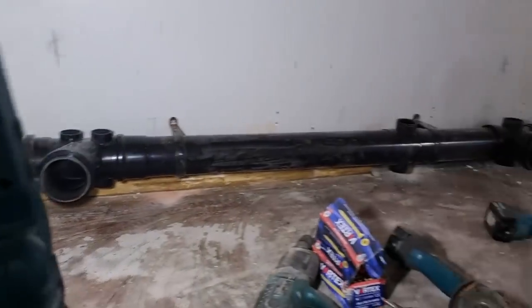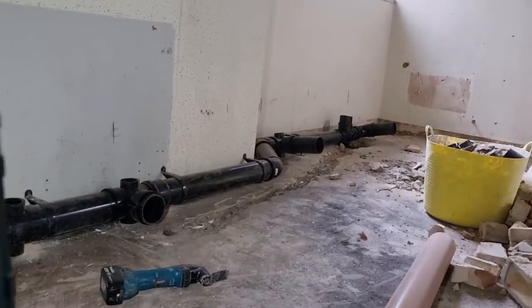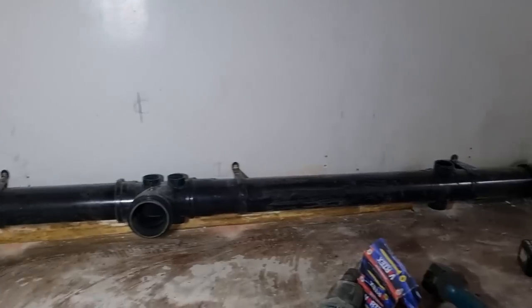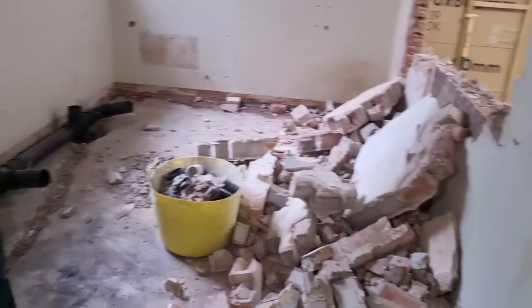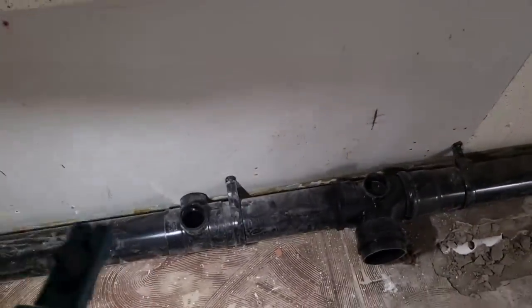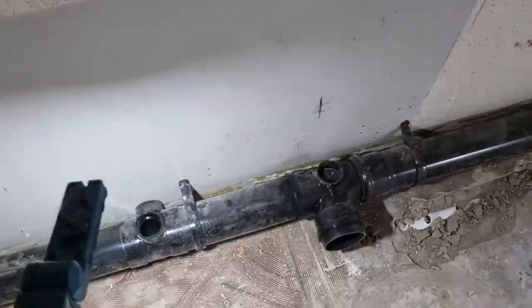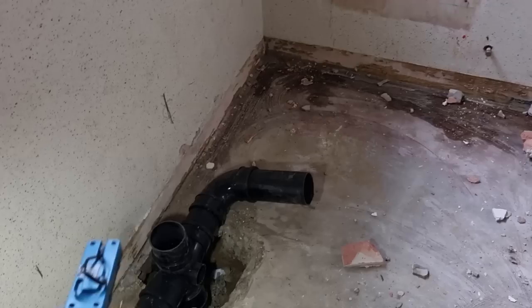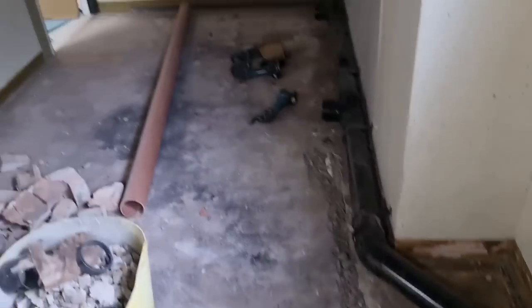Right, that's got that soil pipe all run in. You can see I've got a perfect fall across there all the way back — that'll be absolutely fine. I've done these before like that and never had an issue. It's no different to running it under the ground and teeing it in — the falls are just above ground. Just a good tidy up now. That's a really good start. It's all clipped absolutely solid — you could walk on that. Waste pipes will boss into there; I'll just put a two-inch tee and bring inch and a half into the walls. I'm missing a short boss socket for there, and I'll put a cleaning eye. Thanks for watching — hit the like button if you enjoyed!